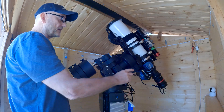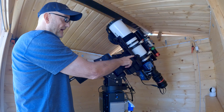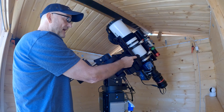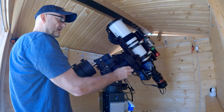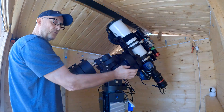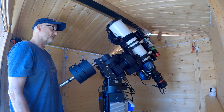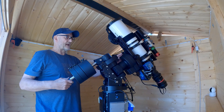You can also get these weights in 100-gram increments and they're really reasonably priced. They come with an M6 hole in the middle — I've drilled these out to M8 and tapped them so I can screw them onto the threaded bolt. You don't need to tap them — you could just use washers to hold them. It turns out that two of the 200-gram weights — 400 grams total — is perfect for my setup. So that's four-dimensional balancing.